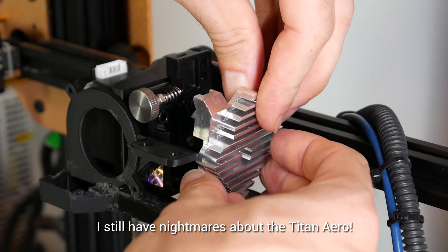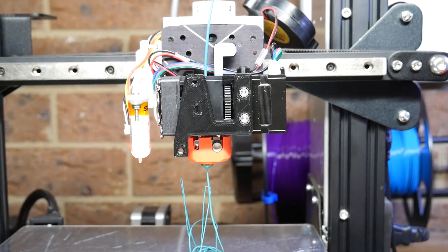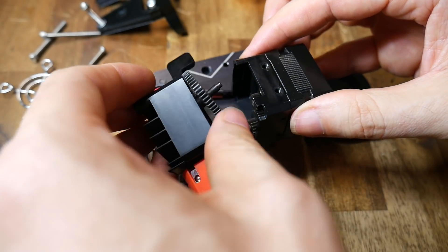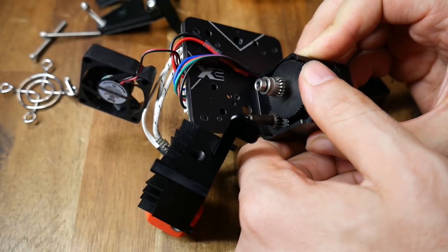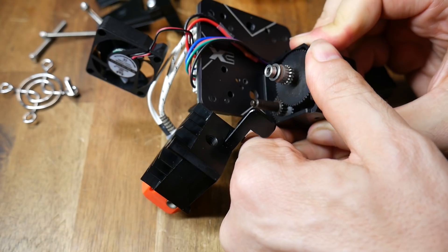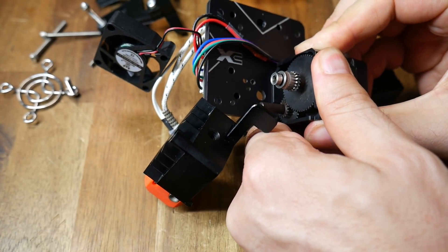That was everything needed for my setup, and the steps really weren't too bad compared to some equivalent products I've tested before. Once I was print ready, that's when I started to have some issues, so let's talk about reliability. Despite everything working as expected through calibration and filament loading, when it came to the first print I had a jam pretty early on, and as it turns out this was terminal. After pulling the H2 off the machine and disassembling it, it was now really hard to manually rotate the gears — the whole thing liked to lock up solid. When I reinstalled and tried to print, the binding happened again.